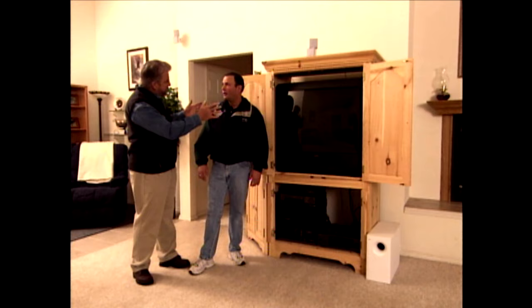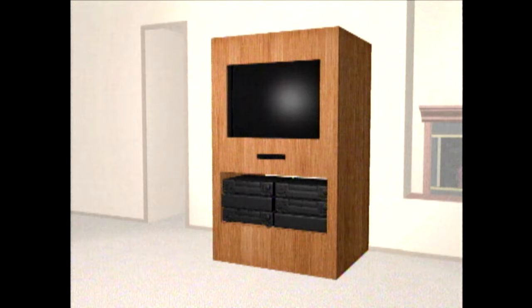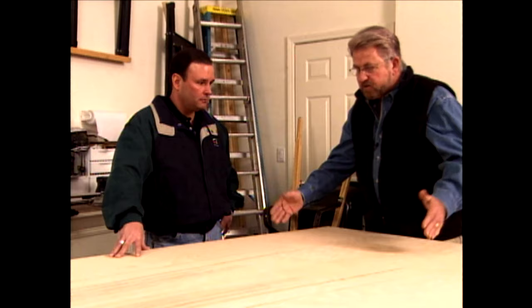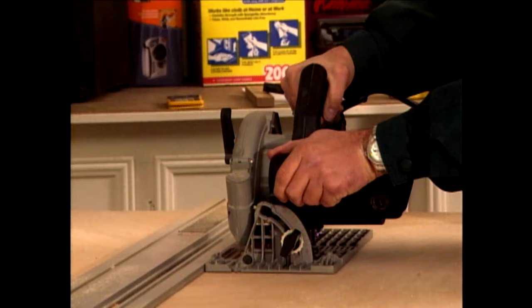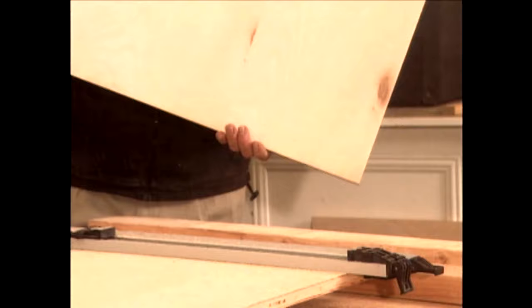Exactly. We're going to build a cabinet with sides, top and bottom, and two shelves. First we'll cut out the parts, then assemble the cabinet, and finally attach a front panel with openings cut for the TV and various components. When assembled, we'll apply a texturing material to the outside and paint it to match the wall, giving the whole thing a built-in look. Taking the depth of the television into consideration, we determine the width of the two sides. We attach a self-clamping straight edge to the plywood — running the base of the circular saw along the straight edge guarantees a perfectly straight cut. After cutting the panels to width, we attach a shorter straight edge and cross-cut them to length.